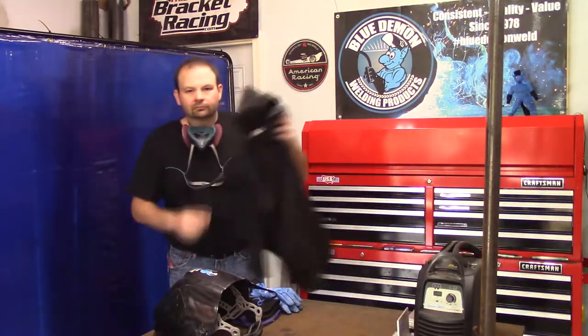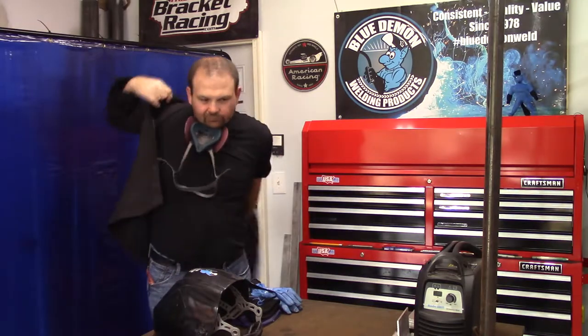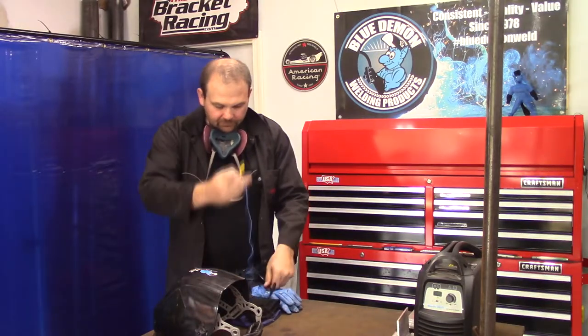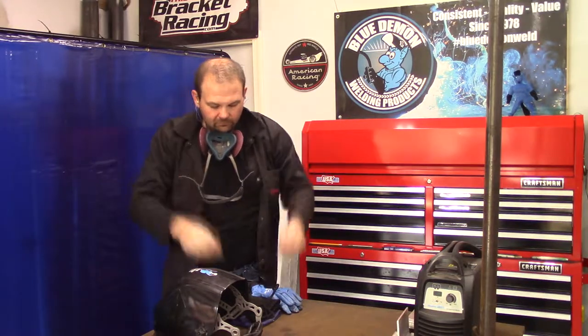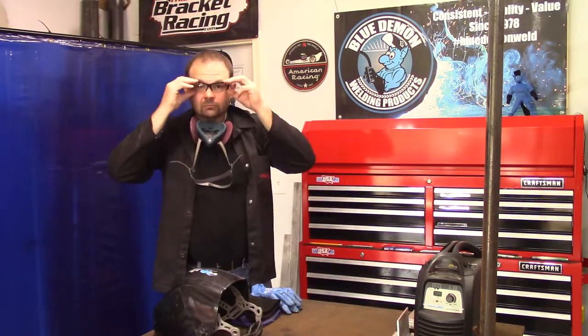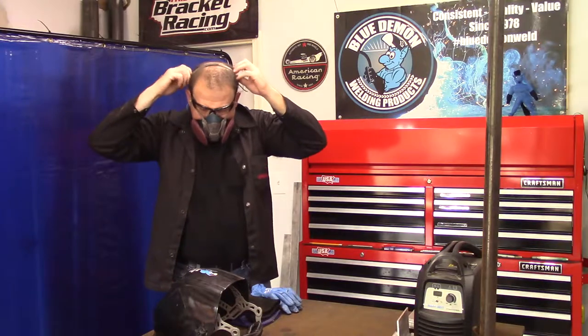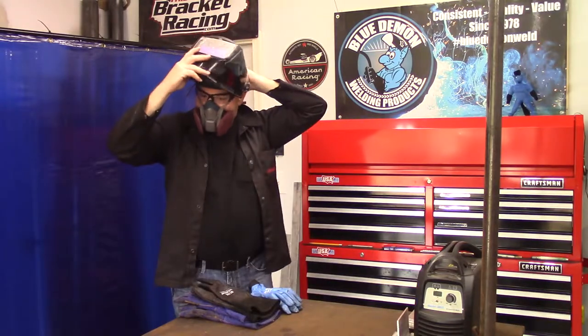Let's stop here for just a moment before I begin the demonstration portion. We need to talk about safety. The welding process can produce harmful light, fumes, sparks, and flying slag, just to name a few. You should always wear the proper clothing and safety gear while welding. This includes, but is certainly not limited to, a welding hood, welding jacket or long sleeve shirt. I would suggest cotton or wool as synthetic materials may melt to your skin. Next, select the proper thickness of gloves, ear protection, and safety glasses. One should always wear eye protection during the welding process.